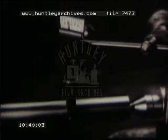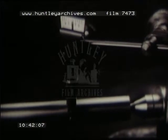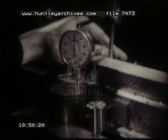Dial indicators have many uses in the machine shop. They are frequently employed to check the centering of work in a lathe. The indicator shows that the work is off-center by several thousandths and that it must be re-centered. Arm-type indicators are frequently used for the same purpose. Test indicators are used to test the straightness of a shaft or to check the mounting of work in a milling machine and for many other purposes.